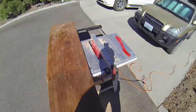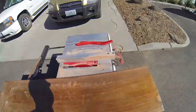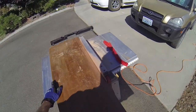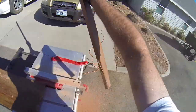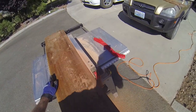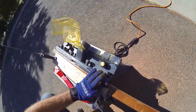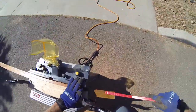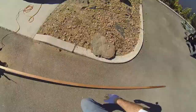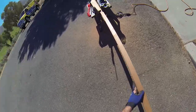That also determined the width I wanted for all the other rail pieces. From the larger piece, I cut the scrap off the edge and left the fence set at the same width. With multiple passes I cut multiple strips the same width as the long piece I had split earlier. I needed at least three strips for each inside gunwale — one for the back, one for the middle, and one for the bow on each side — so six pieces total. Then I set up my router table with a quarter-round bit to take the square corner off three of the four edges and make them nice and round. I did the same thing with the long piece, rounding three of the four sides, leaving only the one face that would sit against the boat.